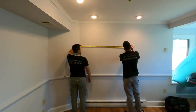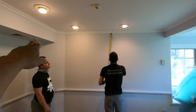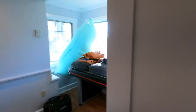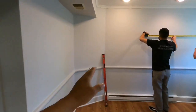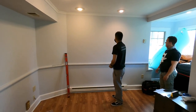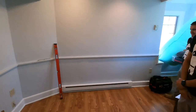Center can be a lot of things. We could have centered between this wall and that wall, or between the tops. But what I chose to do — and discussed with the homeowner — was center between this wall and the top box, which includes this extra inch of offset. When we're back in the seating area, we have a nice working space for our eyes. If we centered off the far wall, the TV would sit way too far to the left and look aesthetically odd. Take into account layout, structure, aesthetics, and viewing angle when establishing working height and center.